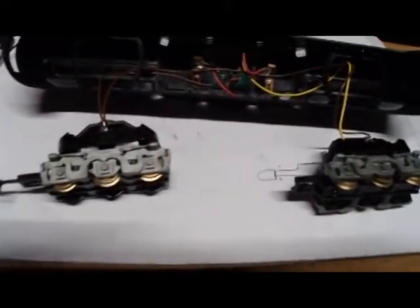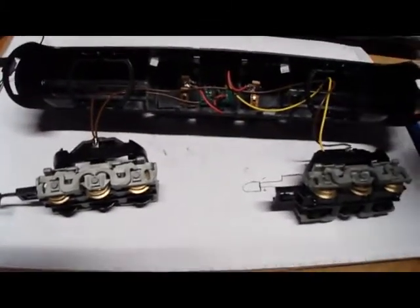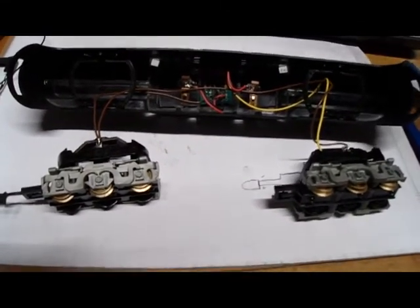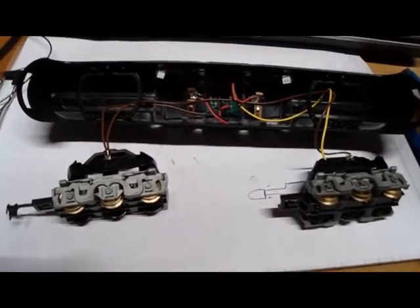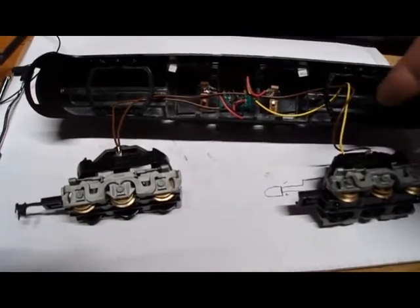I got that circuit board in there and got it wired up. On a lot of old trains, if they look pretty rough, I just replace all the wiring — especially Tycos, because they're usually pretty brittle. I always have older Tycos. When I replace these wires I use a different color, so I got a brown and a yellow. The reason I do that is, if I take it apart, I know I already replaced the wiring in here.